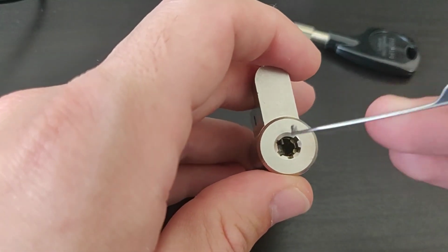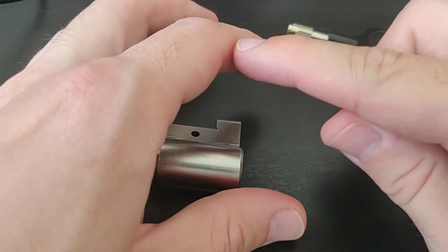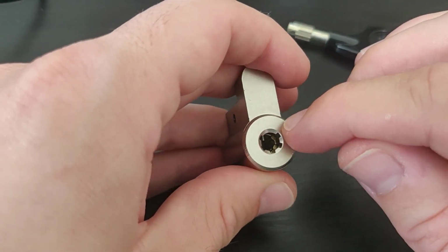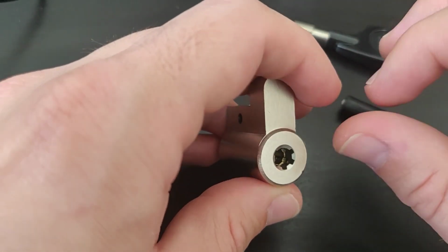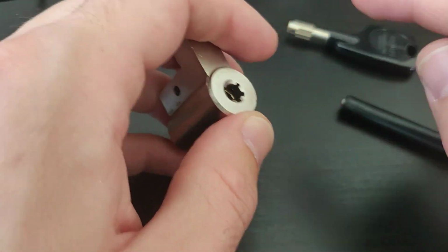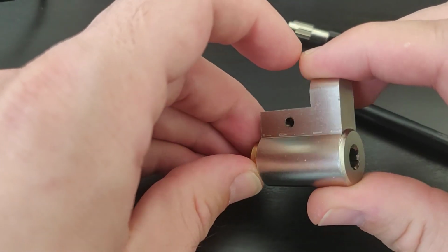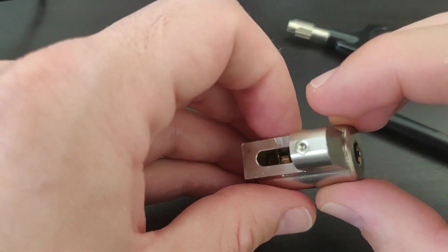And when they align, these metal protrusions I told you about that are sticking out from these two sidebars no longer interact with these sprung pins. So suddenly the diameter of the lock plug becomes quite small, because the diameter is then created by the true gates, and these are quite wider and also deeper, so the plug can rotate. These sidebars do not block it.